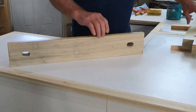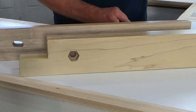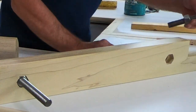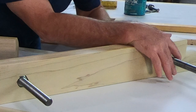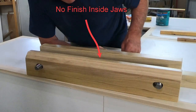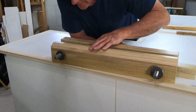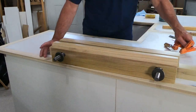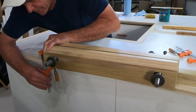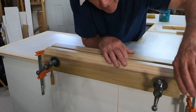Poplar is a nice looking wood with a clear finish on it. I like it because it's a relatively inexpensive hardwood and is really stable. It's also great for painting. The vise is ready for final assembly and to be put to use. Incidentally, I did not put finish on the inside faces of the jaws that do the actual clamping. I think that the clamping pressure applied by the hand screws through the vise is so significant that the finish probably wouldn't make much difference for my uses, but it makes sense to leave the wood unfinished and go from there. The hardware for building this is very simple and straightforward. If you have specific needs for a different shape of clamp or other application, you can see how easy it is to configure your cuts of wood to meet whatever needs you have and then install the nuts and bolts accordingly. Overall, a good little project and I'm happy with the results.